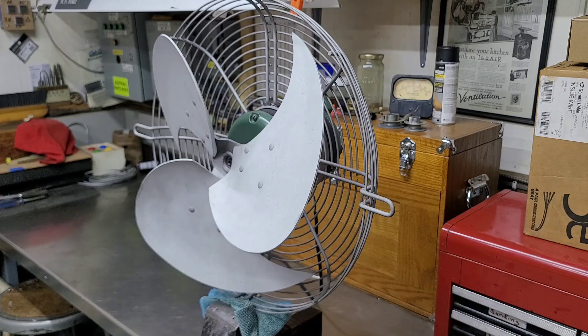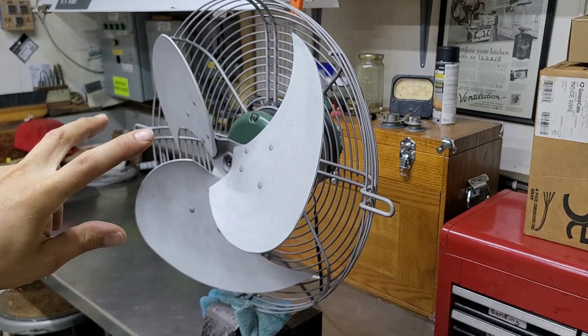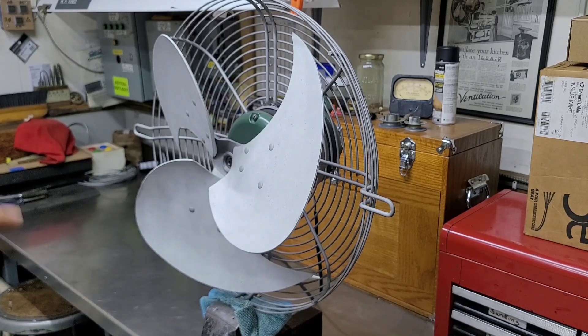You can actually see it — three of the coils were still copper-colored, and three of them were just black, every other coil. So you could tell one of the run windings cooked and the other one didn't. Not the best design in the world, but I rewound it, and hopefully this motor lasts a while now. I had it running for quite some time, and it just gets barely a little bit warm, which I think is probably normal for a motor like this — it doesn't get hot where it hurts to touch it. I consider that pretty good.